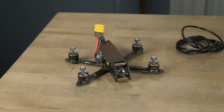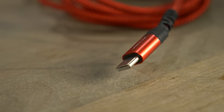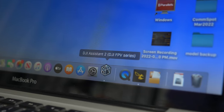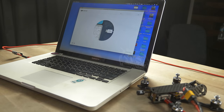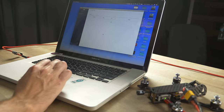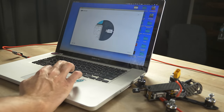To get everything set up, you need a computer plus a micro USB cable and a USB-C cable. Start by activating and updating your Caddx Vista — plug the USB-C cable into your computer and into the Vista. Open up the DJI Assistant 2 DJI FPV series program from DJI — we'll leave a link in the description. Plug a battery into the drone to apply power to the Vista, wait for the program to recognize it, then click on the unit, hit Start Activation, confirm your account, and wait. Once activated, you may be prompted to update, but this one is already on the latest version. Unplug the drone and shut down the DJI program.